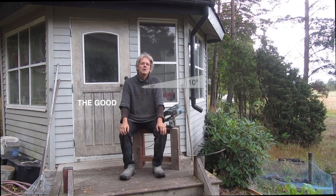That secondary bevel is made at a higher, steeper angle — about 20 to 40 degrees. And then we will get an edge that is very sturdy. It can be used for everything from fine grass cutting to tree saplings. It's good for every use of the scythe. It's the perfect edge geometry for a scythe blade, according to my investigations and experience. You shouldn't use anything else. That's the good edge.